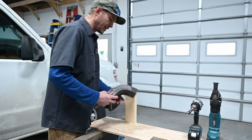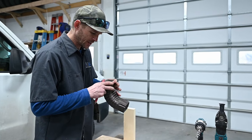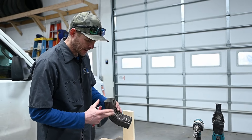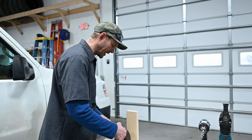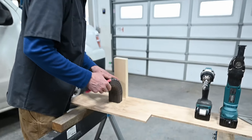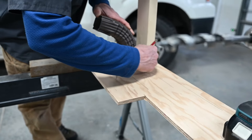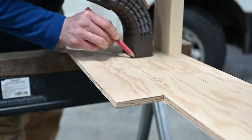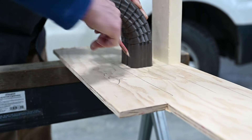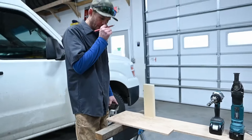We've got a deck joist going this way and another going this way, so we have to avoid both and go into the area that's just open underneath. We have our downspout coming down. First thing I like to do is make sure these elbows come a little flared — look at it, make it a really nice shape before you start. Kind of bend it around so you have a nice-looking opening. Put that piece on the deck and trace it out — that gives you where you're going to put your downspout.